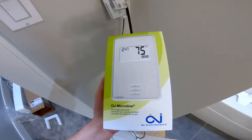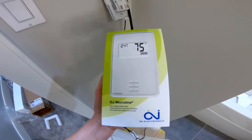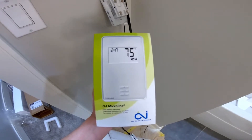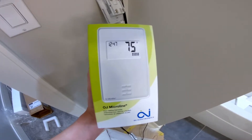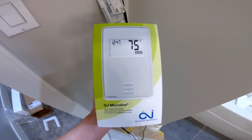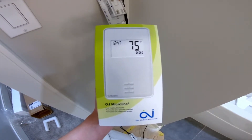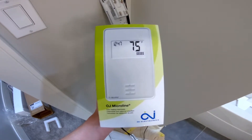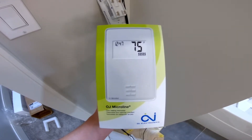We're just finishing up the installation of the controller and thermostat for the in-floor heat. This is the Warmly Yours non-programmable thermostat — their baseline model, but it looks pretty good. Generally with heated floor systems, you aren't changing the temperature day and night, as they take a while to warm up and cool down due to the mass in the floor. In this case, I've only got it hooked up to a 120-volt circuit, not 240, so it doesn't have a whole lot of power either.